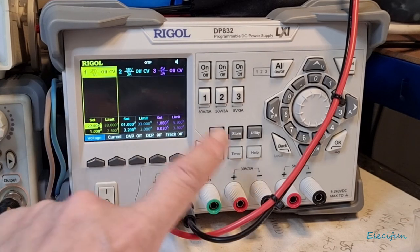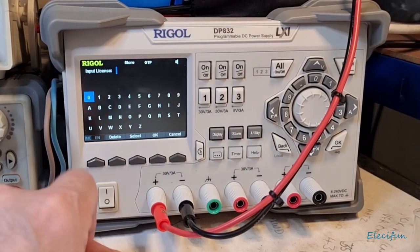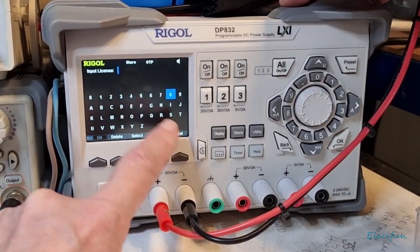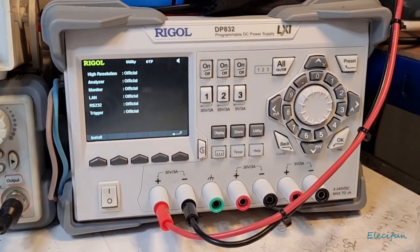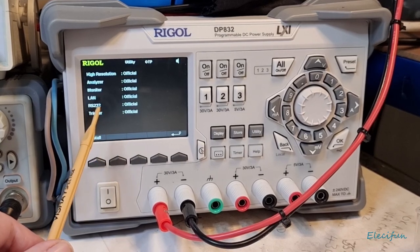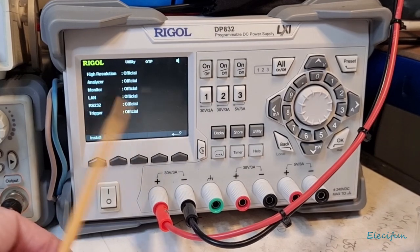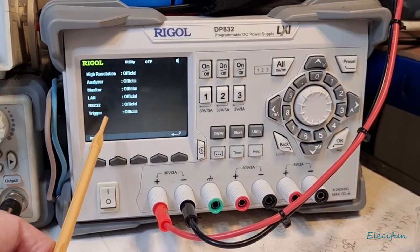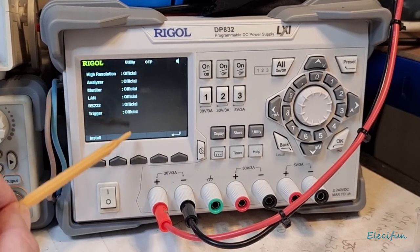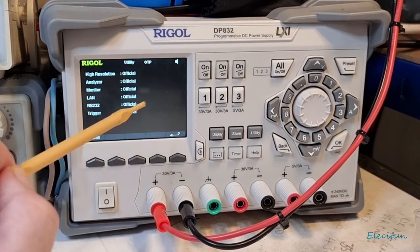Going into options and having to go through all those 28 characters — understandable. But what I noticed was, and if you can see here, I didn't put in my RS232, but when I did the hack to change it to the 832A, it automatically put it in there. Why is this? Well, I went and looked up on the Rigol website and all of these options for the 832A are pre-installed — so you get it all.